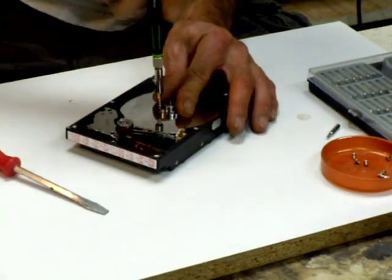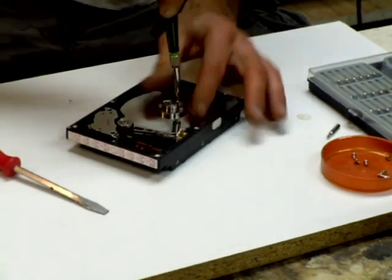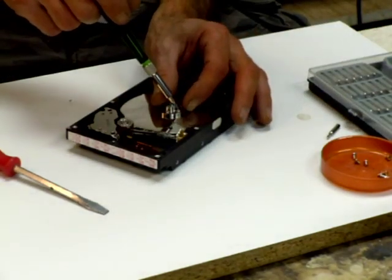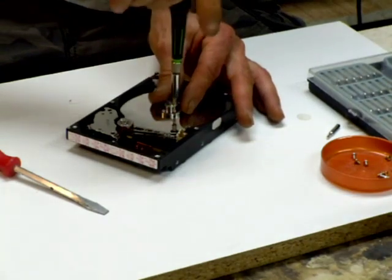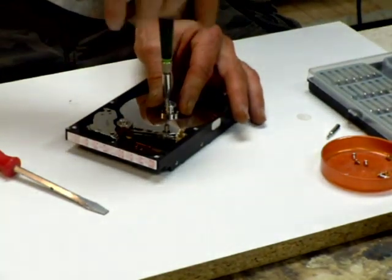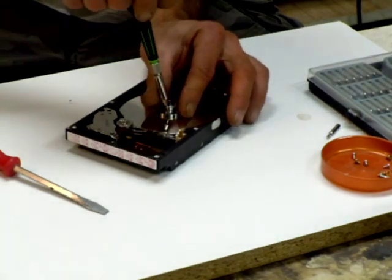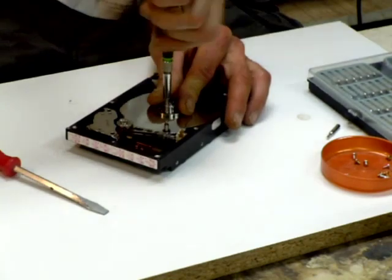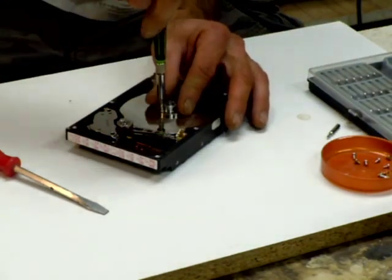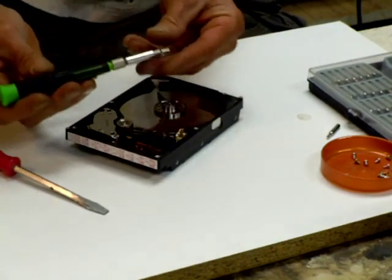And so much for a hard drive. I didn't trust this one — it's a Deskstar, like a 60 gig, but these were failing drives, so I don't trust it. I got some magnets — hopefully more than just one; there might be two in this one. I ultimately want to put 24 magnets on this wheel — I think I mentioned that already. I got 18 on there now. I need to make a new coil for it too; the one I got now is pretty small.